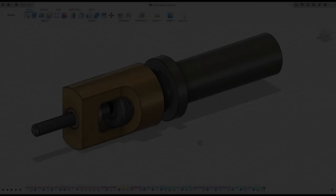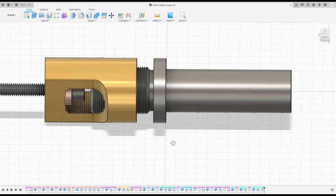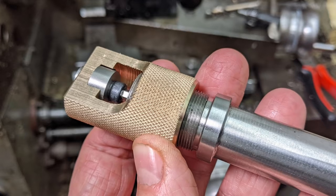I was inspired by a video, probably on YouTube, but I'm sad to say I can't find it now, so I can't acknowledge the source. The clever innovation that I picked up was to use a set of quarter inch hex screwdriver bits to fit into the head of the screws I was modifying, so they're firmly held against rotation.